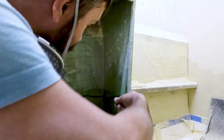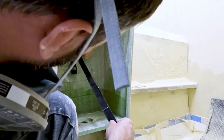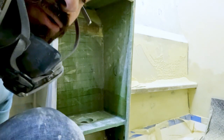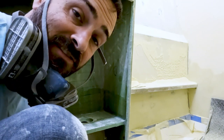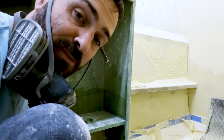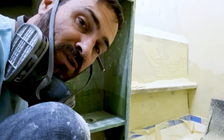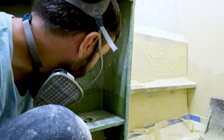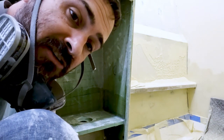And now the process is just figuring out what height I want them at. I'm probably gonna do one right about here, one right around this height then. Go through, sand and prep the surface, and then just a quick little fiberglass. Again, not cosmetic at all, just purely a structural thing. And it's gonna be high in the tank anyway, so we'll just use our 1208, which is the stuff with the fiberglass mat on it, and it adheres a little bit better to the surface. So I'll just prep this real quick, sand it, and then we should be good to glass.